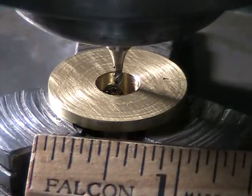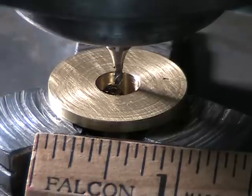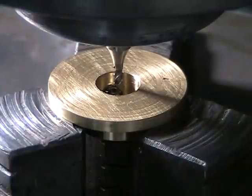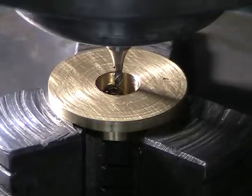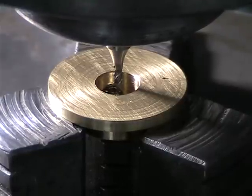I've got a 1/16th inch end mill in the milling machine and my G-code all set up. I first designed this spiral in Visio, then exported it to a DXF file and imported that into CamBam, where I used the engraving option to set the depth. From there the G-code goes into Mach 3, and the program is loaded up and ready to go.